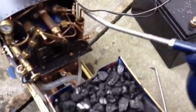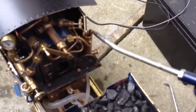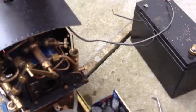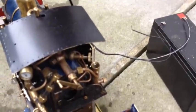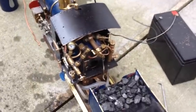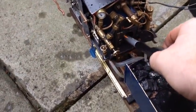Once you've oiled all the moving parts the next thing is to put steam oil in. This is just Roundhouse steam oil that you can get from them. I fill it right to the top and you need to fill that up every hour or so of running. The boiler is already full of water. The blower is in place and I'm ready to put the other cable on, so now we'll just light the charcoal.